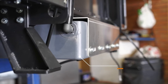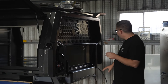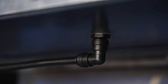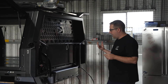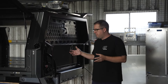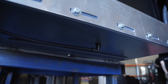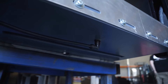Down below here, we've actually got a 60 litre water tank. You'll notice there's a few different hoses here and there. We use the John Guest poly hose with the push lock fittings — this is what they use in the majority of the caravan industry. Getting parts around Australia is pretty quick and easy. And if you ever have an issue on the road, for example, your pump wire got cut because a stick came up and ripped it out and you need to get water out of that tank, you can get underneath the car — it's just push and release and you can have water out of that tank.